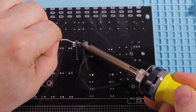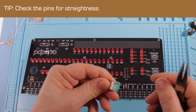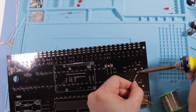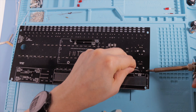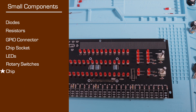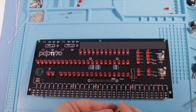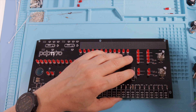Then we want to run through the rest of the contacts pretty quickly. Next, we need to put the rotary switches in place. Chances are you'll need to straighten the pins on these a little bit to get them to drop in. Make sure that you get them to go all the way home to the pin's shoulders, then tape them down. Tack two pins in as usual before going the whole way around, making sure they're square before you finalize your soldering. Flip it back, pull the tape off, and make sure everything's still square. With the board face up, we want to mount the chip. The chip should have a little dot or notch too — it needs to go the right way up. Check how far the pins are splayed; if they're not close to 90 degrees, you may want to gently push them over. Try to set the pins into the socket as closely as possible before starting to apply a little gentle pressure, and make sure that they're all getting started before stuffing it the whole way home.